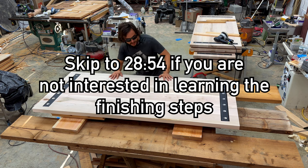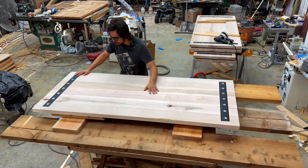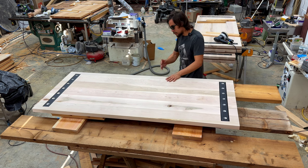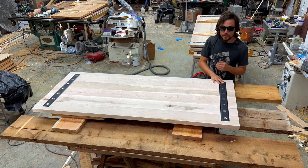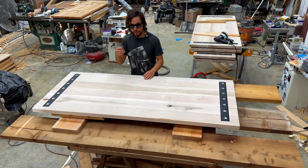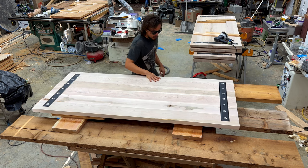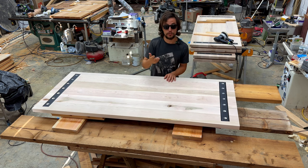What makes a good table? For starters, a good table is beautiful, flat, strong. But the tables that really stand out are the ones that have been around forever. For a table to last forever, not only does it need to be milled flat — probably the most important part after you do everything else is the finish. A really good finish is beautiful, super strong, and flexible because wood is going to move.